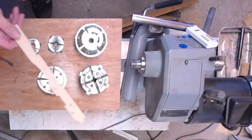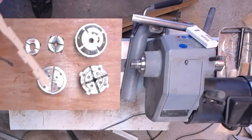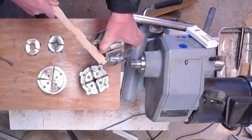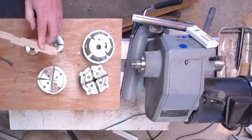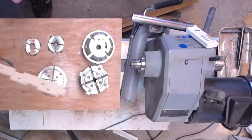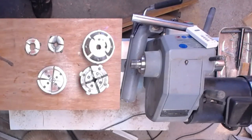This is one for the mortises, where I have the mortises of my various jaws. And this isn't how it's supposed to be used, but you can drop it into the bottom of the piece of wood you're working and just check the size. There's a center mark on them here, so that I can use that center mark on the center of the wood, stick a pencil there, and draw myself an outline for my mortise. And it's simple, it works, gets the job done.